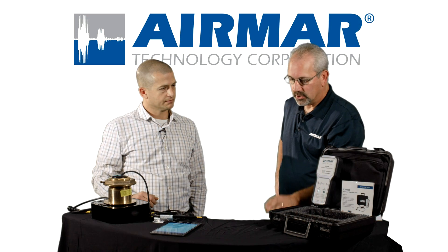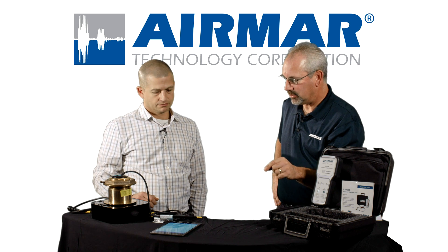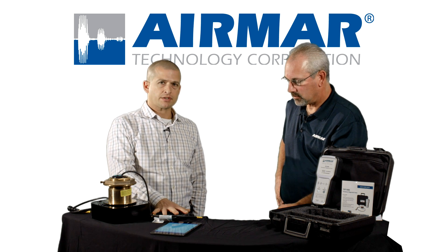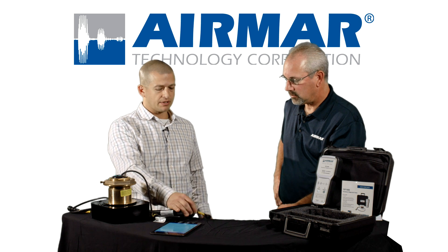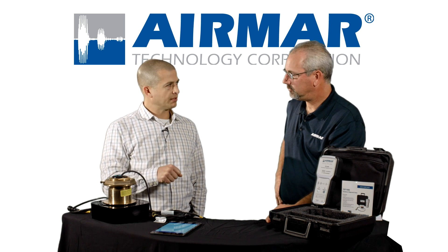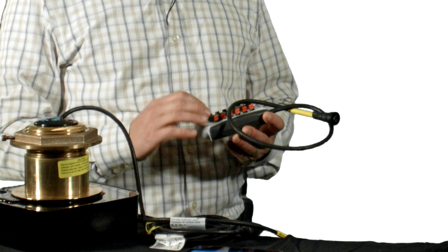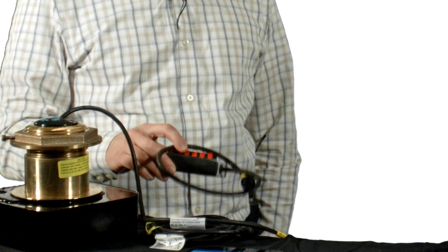So let's talk about connecting your TDT to the transducers. There's a couple of different ways to do that. Can you walk us through connector cables and breakout box? All AirMar transducers are going to have either a molded connector on one end or flying leads. For all transducers with molded connectors, we offer adapter cables. All of our adapter cables have this yellow band on them that connects into the TDT-1000 — no transducer plugs directly into the TDT-1000, always using an adapter cable. And for transducers with flying leads, we have a breakout box. This allows you to plug in the wires you have available. It's color-coded with signal explanations on the back. It's the catch-all for everything that doesn't have an AirMar connector.